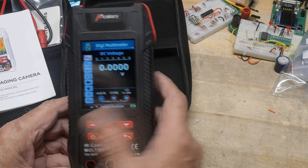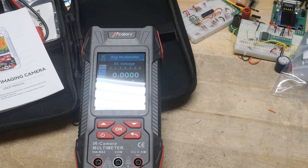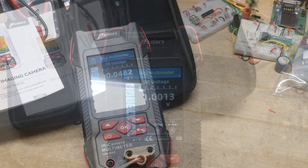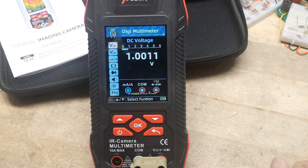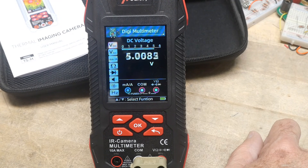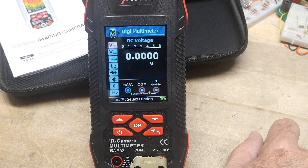Let's go ahead and hook it up to a nice source. I'm going to use different leads on it — good spacing. Here's our multimeter. I'm going to be using my voltage calibrator over there. Looks like it has an offset in it. Let's put it on 5 volts and let's change polarity. Yeah, it just has an offset in it, so that's a little bit disappointing. Could have been better. Here's zero volts — there's no offset at zero, so it's just part of the calibration.